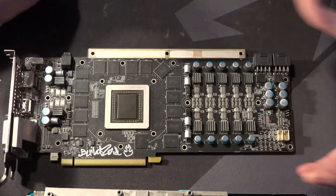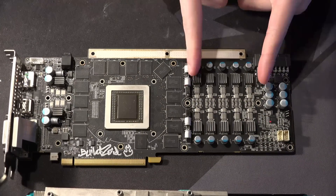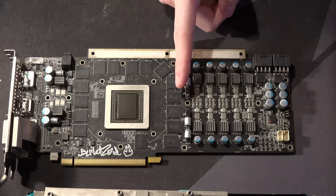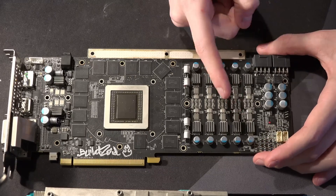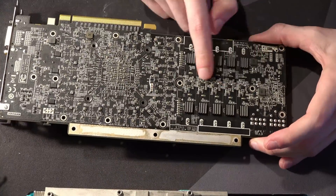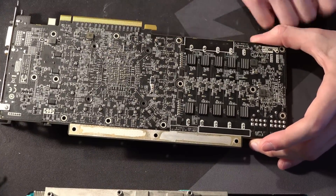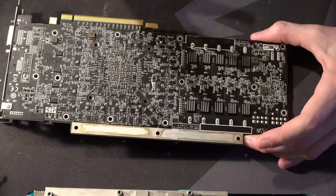Now let's go to the PCB. VRM — this is all Vapor. This is our Vapor VRM over here, controlled by a 3567B, 10-phase IR-6811 high-side MOSFET, IR-6894 low-side MOSFET, driven by a bunch of IR-3598s located right over here in a straight line.